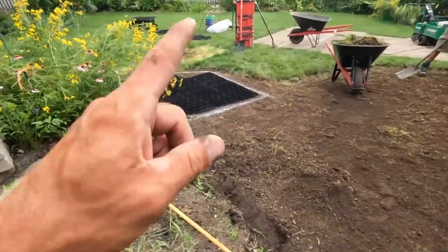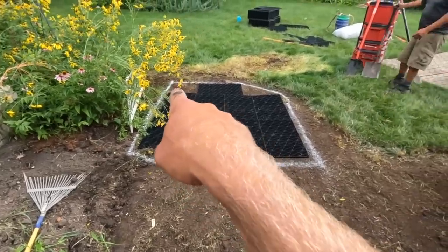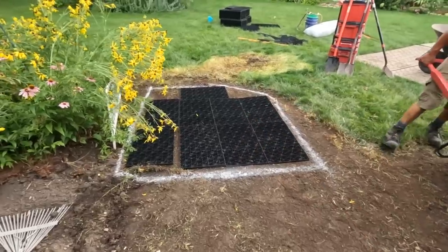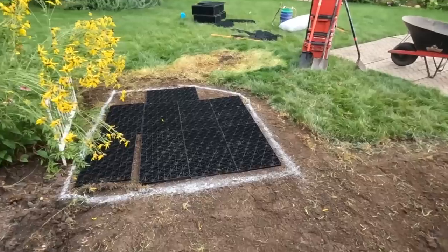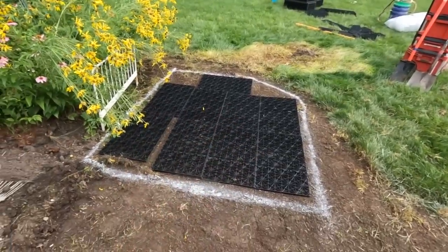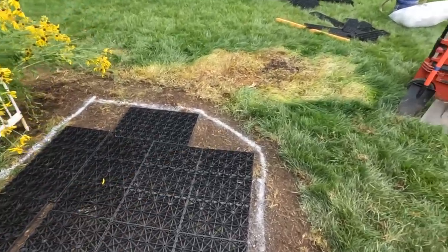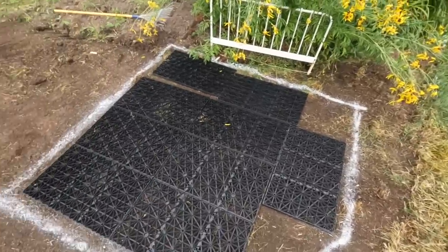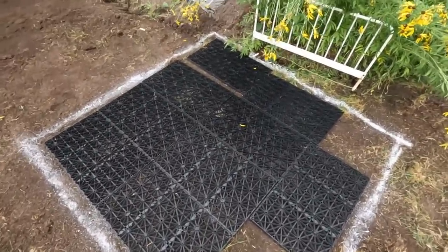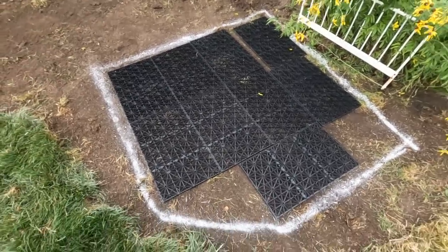Now what we're going to do is construct these aqua blocks as well as dig this hole for the reservoir. I think I'm going to put the pump vault back over there and then fill that little triangle space with some of the cobbles and large gravel we have out in the street. Rather than doing a three by three footprint with that reservoir creeping back this way, I'm just going to go with four, four, then the one and then the pump vault, and I'll make sure that we support it on both sides. I'm not too worried about the compression because of the size of the reservoir being so small, but normally I'd like to have a square footprint in through here.